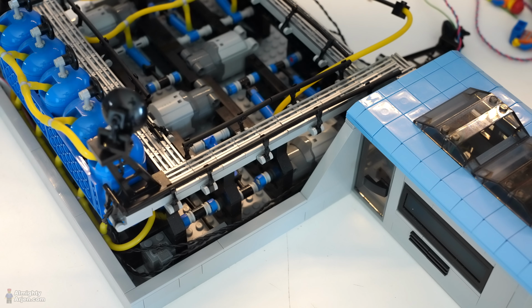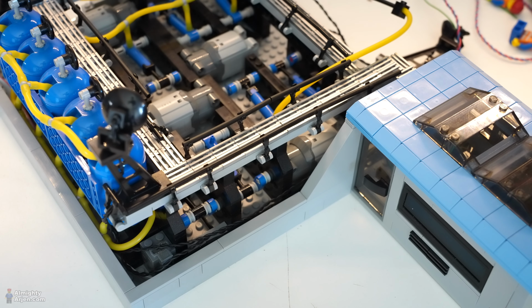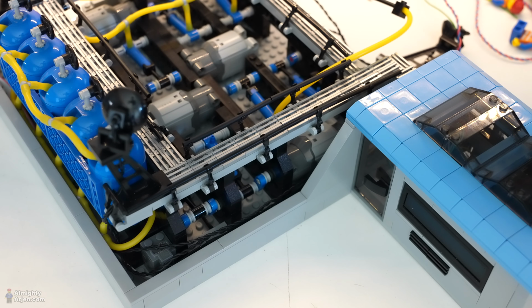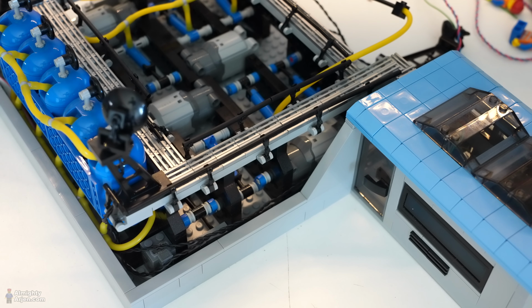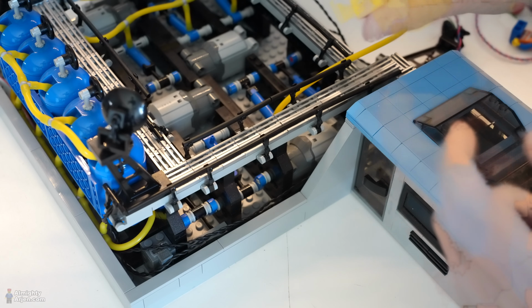Because if I'm going to do that, I want to change all pumps, because I don't want to leave in pumps that are fine now, but stop working or start leaking within a month or two. Then I'm just servicing this compressor all the time. But it's a big guess, of course, because you don't know if these new version 2 pumps are better. Though it is described as having another cylinder inside, which suggests that they should work better, should be more stable.